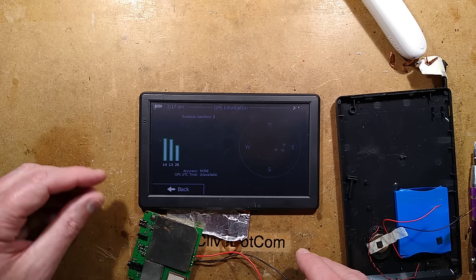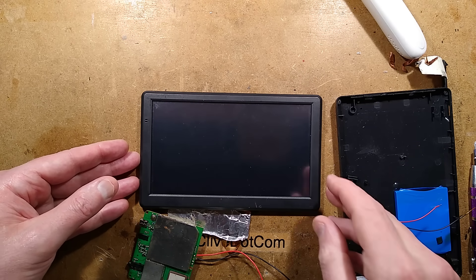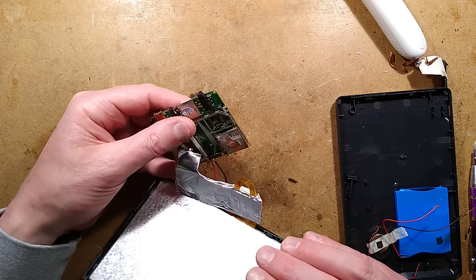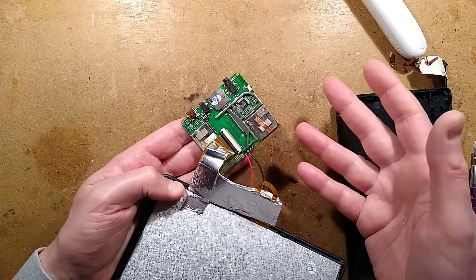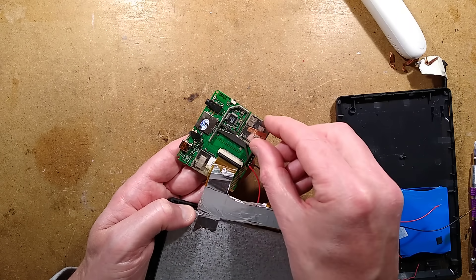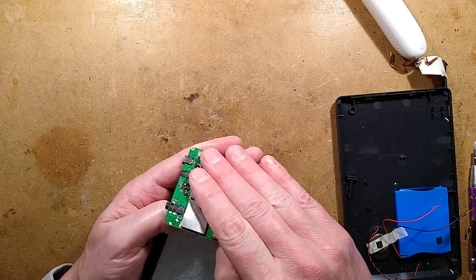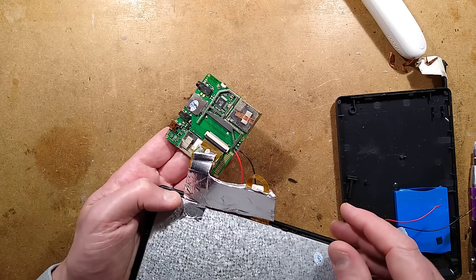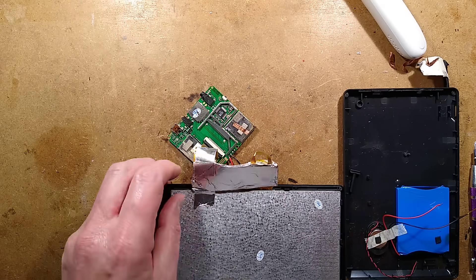But it's good that it's actually locked on three of them and is occasionally spotting another one, yo-yoing in and out — typical of that sort of early sat-nav behaviour. Interesting enough, I think that is the diagnosis: the battery was just getting a bit weak, the voltage was dropping, and that's why it was getting a better lock when the battery was fully charged with that slightly higher voltage. And the integrity of the foil, and the fact it's had moisture in it at some point, is never going to help. Worth taking apart and exploring inside.